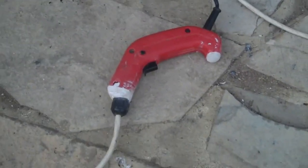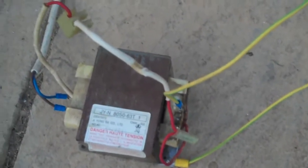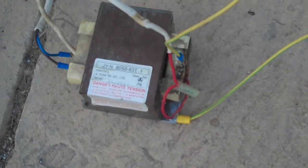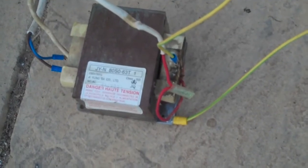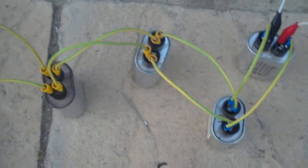Which means I can stand a little bit away from it and turn it on. On the other side of it, which is the output side, and on this side it's the thin coil — so it's a coil made up of thin wires. This one's connected through the ground of the main part of it. There's the ground connection there, screwing to the main block of it. And then the other side of the coil connects to these four microwave oven capacitors, which are connected in parallel. That then is connected to this little thing.